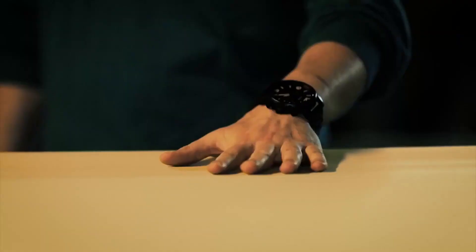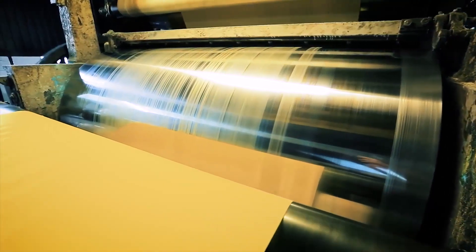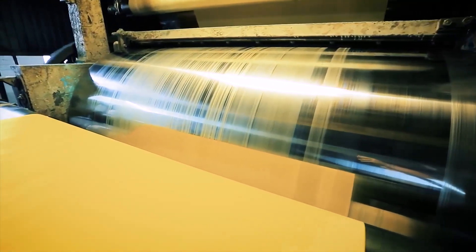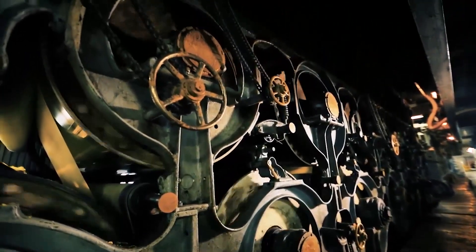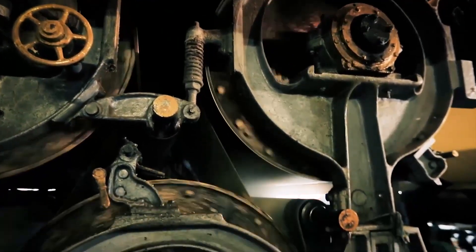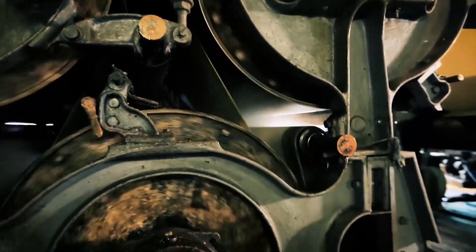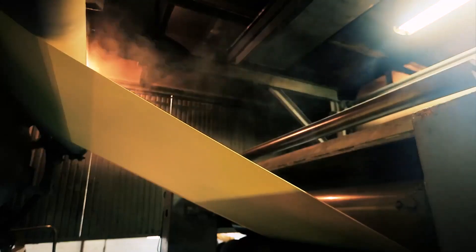At this stage, you can even touch it without fear of damaging it. The following process is similar to what happens with laundry after washing. While still wet, papers pass through a series of cylinders. Some extract it. Others heat it from inside with hot steam to dry it. And the third polishes it.